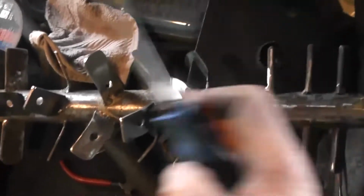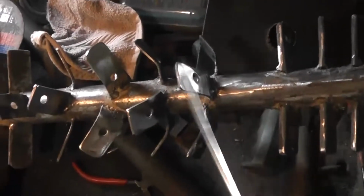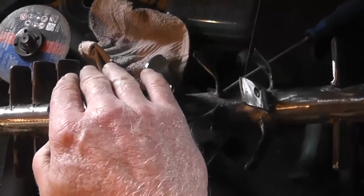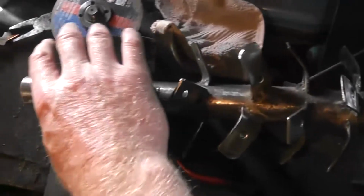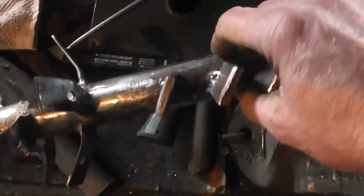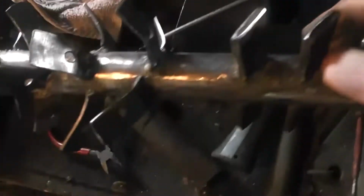I angled them forwards, even though they were all the correct length, with the idea that the airflow is coming in, and if it hits those, it's going to pull them down. I want the airflow to go down and stay around this area, and then when it gets to the end, I have these fins at the same angle, 45, but this time it's to start deflecting the airflow out into the exit port. Airflow in, airflow out.